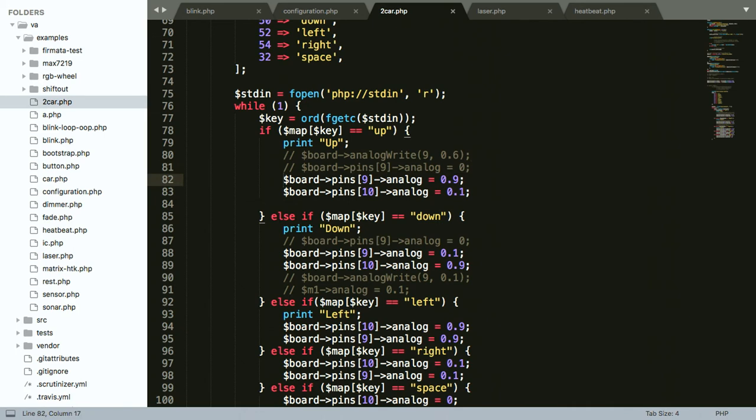But so if you can see, this is inverse because the motors are inverse, because they're on both sides. Therefore, the direction of both is not front at the same time, because they're on opposite sides. One motor is on this side, rotating clockwise, and the other one would be turning anti-clockwise if you do it, because it's on the other side. So that's why it might be confusing that they are set to different values.